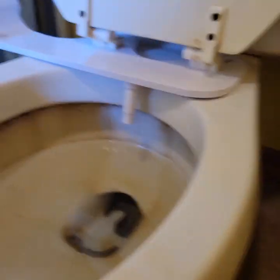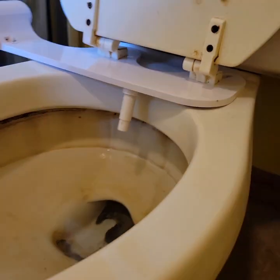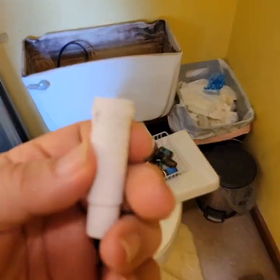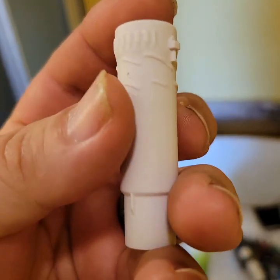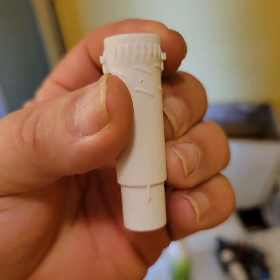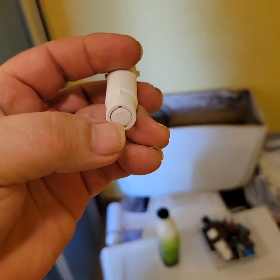There you have it, all fastened down and ready to go. This adjustment right here takes the nozzle and adjusts it so it shoots front or back — female setting, backside setting. This bidet comes with an extra nozzle; it's keyed so you can't put it in backwards. The line is supposed to be facing forward. You slide it in, turn it about 90 degrees, and it locks into position. When water pressure goes in, this opens up and extends even farther down.